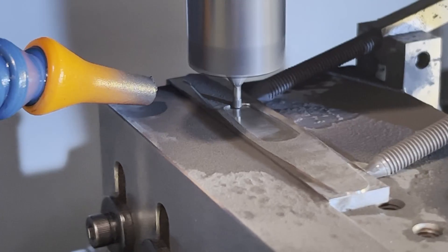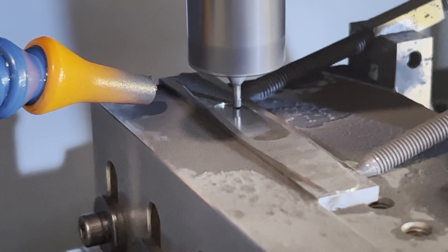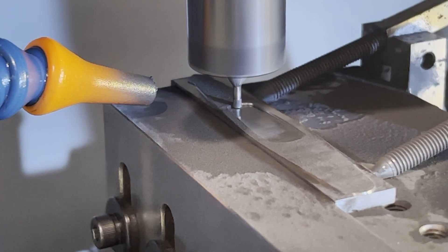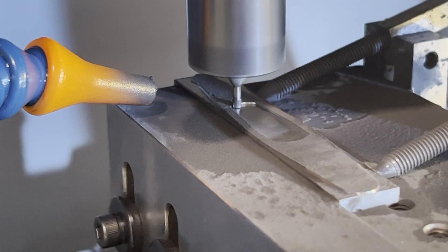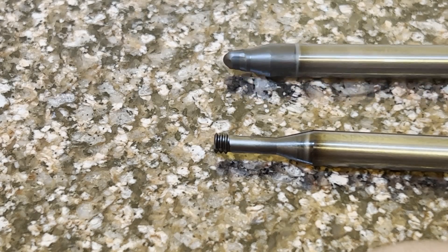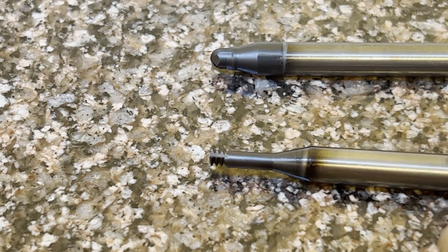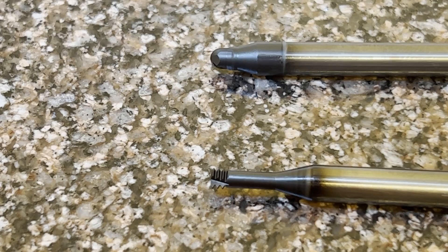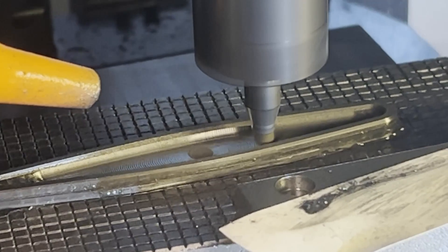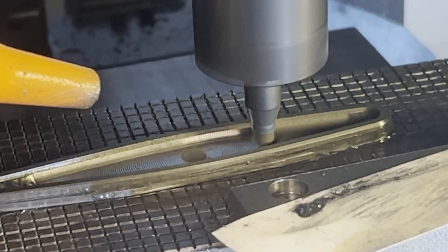As you can see it has just such low cutting force. I'm holding this one part with just two M5 screws and it's only holding on by two millimeters on the edge of the rib — and it's incredibly stable. You can also see what a nice floor finish it yields. I really like these cutters but they don't always work out from a job shop perspective, so I use the coated ones a lot. The ball mills have the problem that each one is a little different in size, so sometimes if you're doing 3D contouring you have to constantly update your CAM program. But you can also use the ball mills as a feed mill, and they offer pretty decent metal removal. Not as good as the solid PCD, but I'm happy with it for most projects.